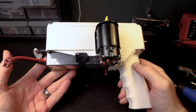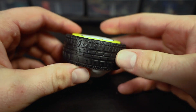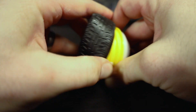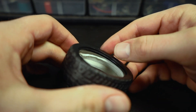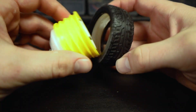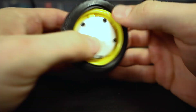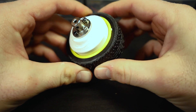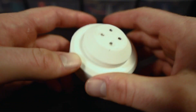Dog Ball Launcher Mark II is assembled and ready to go, but I found another issue with this design. Now that the wheels no longer fly off the hubs when they get up to speed, the tires have actually started flying off the wheels instead. These wheels are super cheap and came with an electronics kit I got a few years back, so they're definitely not meant for high-speed applications. They have a sticky foam lining on the inside that's not evenly distributed, causing quite a bit of vibration at higher RPMs. Secondly, the rubber of the tire is actually pretty stretchy, so it ends up expanding at higher speeds and sliding off the wheel — essentially turning it into a tiny rubber frisbee. So in a last-ditch effort to get this project working, I decided to just 3D print the wheels myself in hopes of reducing the vibrations and eliminating the possibility of getting a flying, spinning rubber tire to the face.